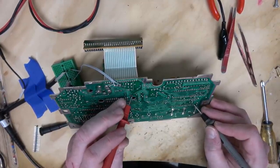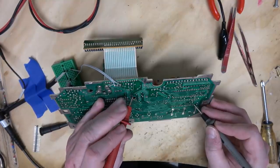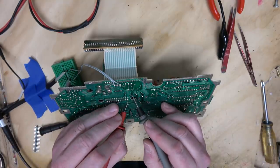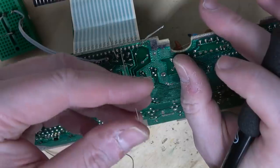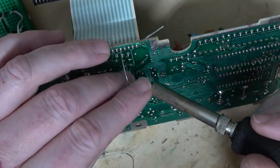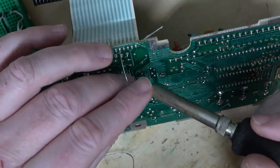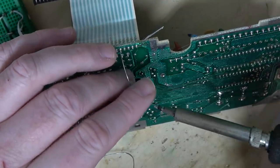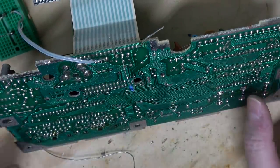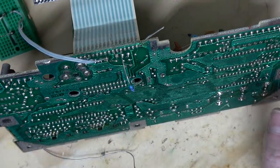Reset the CPU. Okay, that's definitely reset. Where is this going? Of course it's under the cartridge slot and I'd have to remove pop rivets. I'm going to do a 10K resistor to VCC connected to reset, and then a switch. In theory it will keep it out of reset, and when you tap the switch it should reset everything and execute properly.